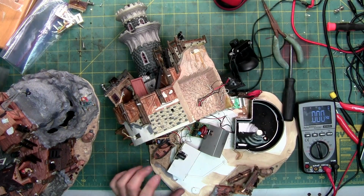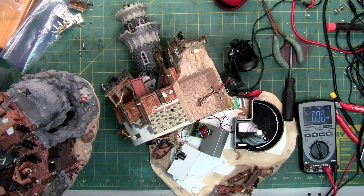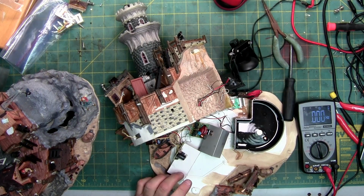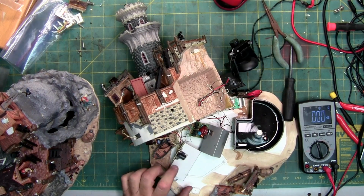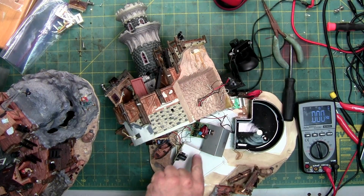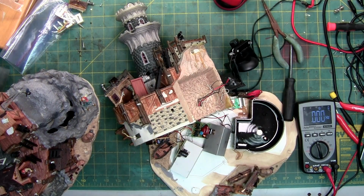It's not misting, and if I separate the two circuits, you notice everything got quieter, which is what I was telling you before. All the connections are good. I have no idea why, but one side has got power, one side doesn't. I'm assuming that it has a bad voltage regulator, which is what these, let's separate these again, which is what these big chips are right here that are screwed into these monster heat sinks. I ordered a couple of voltage regulators. Unfortunately, they didn't show up.